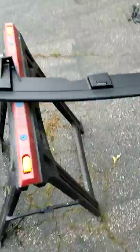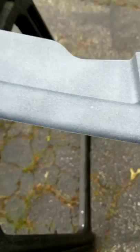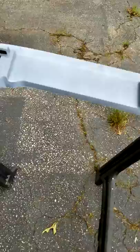First, put a couple of light coats of primer on there and get it primed up, then let it dry. You should do several light passes. This is the first pass and as you can see, the original black plastic is still shining through — kind of a pepper shot effect. That's really all you want for your very first coating. I went a little thick there by accident, but it's okay. What you're trying to avoid is runs — any runs that show up now will show up in the final product.